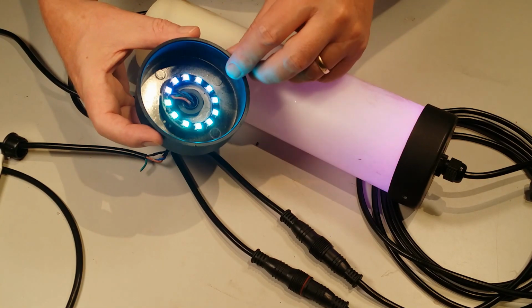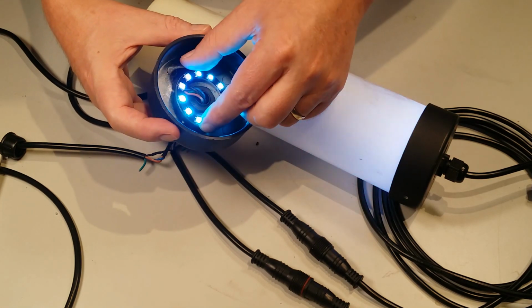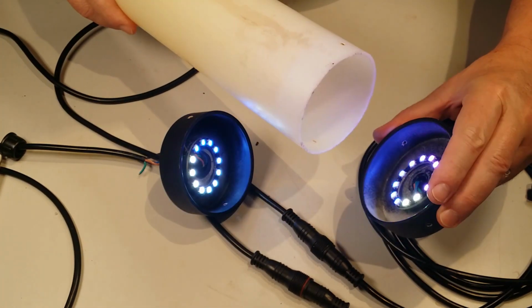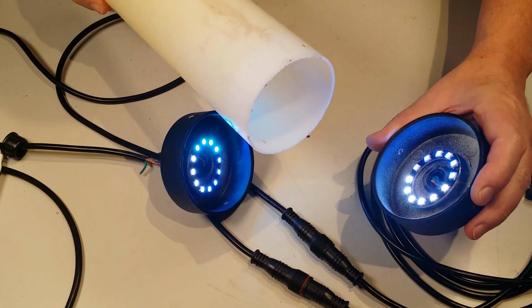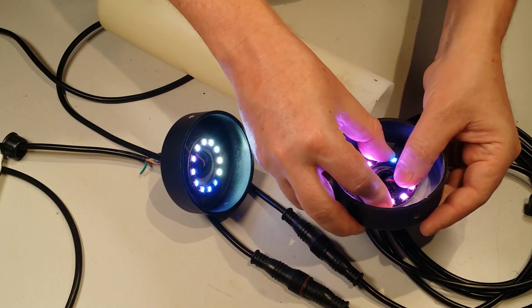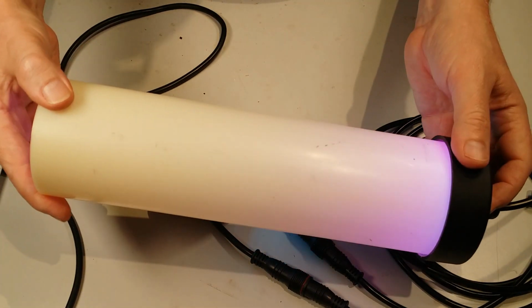So this is the 12 pixel one, and you can get them in different size rings. There's a single pixel. I'm not sure what the next size is. I think there's a 3, maybe a 6 or something like that. Then there's an 8, a 12 and a 16 and probably a 24 pixel or something like that. I didn't want it to go all the way to the edge because I've got the tube that has to mesh in there, so I needed some gap. Could have gone for a bigger one, but that just would have been more channels. Yes, it would have been a bit brighter, but probably no huge advantage there. Could have maybe gone smaller, to 8 pixels, but there would have been less light output, and it might have been quite tight to get the wiring to dress down in a nice spot there. So I'm going to silicone those in place in due course and do some more testing, but that gives you a bit of an idea what you can do with these tint tubes.